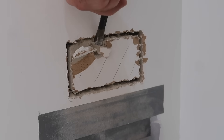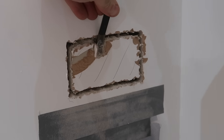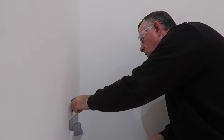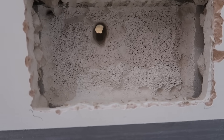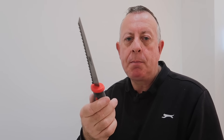Because the brickwork seems quite soft, I use a small cold chisel I've had for some time but never had occasion to use. It wasn't long before I had the majority of the material out and could tidy up the sides and corners. That was pretty straightforward, mainly because the blocks this wall is made up of are so lightweight — they're like honeycomb — they break really easily and drill even easier. Now if this was a stud wall I'd have cut that hole using what's called a jab saw, putting a couple of holes in each corner and sawing the plasterboard in quite a nice line.